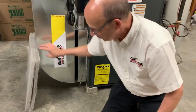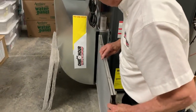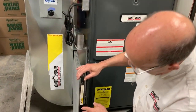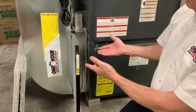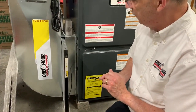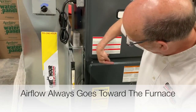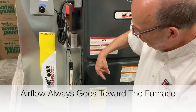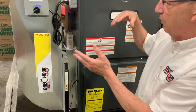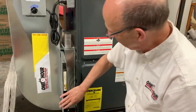There's our dirty one — we're going to take that to the trash. The new filter we're going to simply slide back in. If you're ever curious about orientation, just put it back the same way you took it out. A lot of times folks question which way the airflow should go. Know that airflow is always going towards the furnace, so the air movement is going towards the furnace regardless of which side your return air is on.